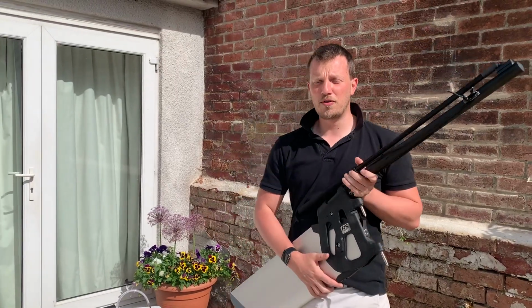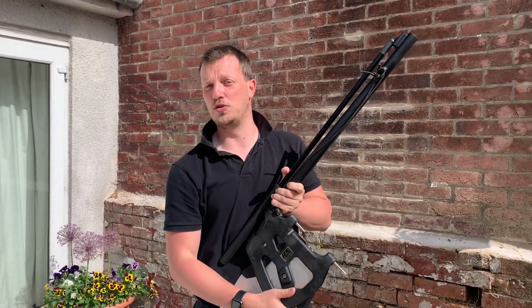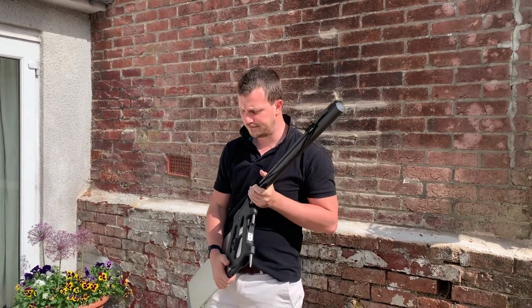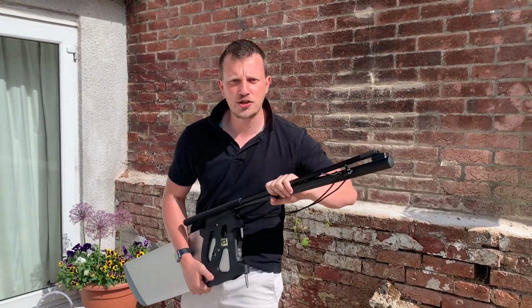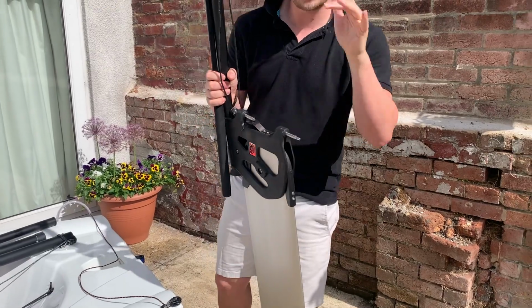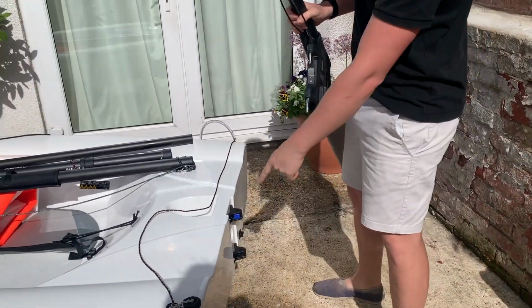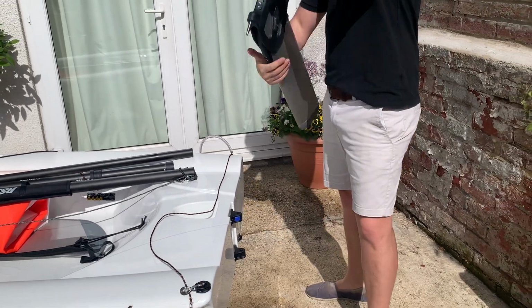So we're going to put the rudder on, and if you haven't seen our boat parts video, take a little look at that because I will explain some of the technical jargon that I'm going to use around the boat. Anyway, tiller and tiller extension under the horse, and then we've got these two pins called pintles, and we've got two holes here, they're called gudgeons, two pins in the two holes, and our rudder will be on, something like this.